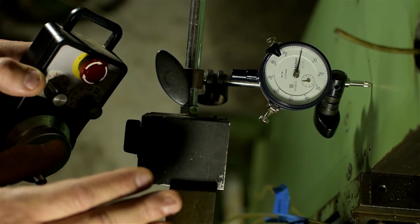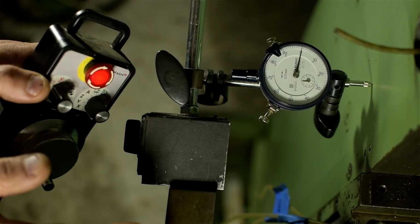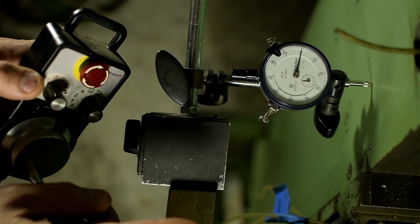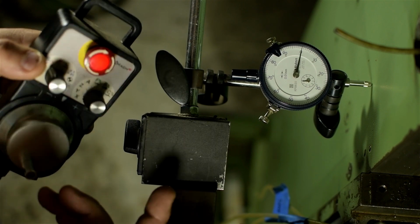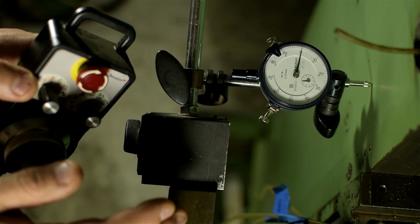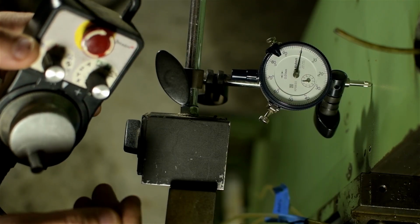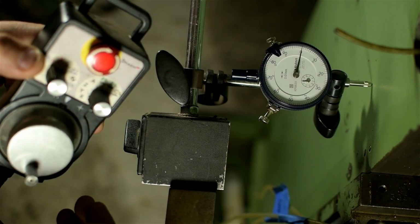Doesn't really matter. But anyway, the gib's not snugged up yet. The machine is definitely not properly lubricated. And most importantly, the tension on the thrust bearing on the other end, well, it isn't really set. I just sort of snugged it up when I put it together. That said, let's try this anyway. I'm going to bump the machine a millimeter at a time, 40 thou at a time. We'll do 9, 10 millimeters, and then come back to 0. Hopefully anyway.